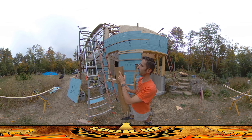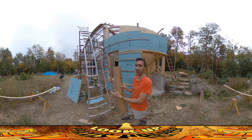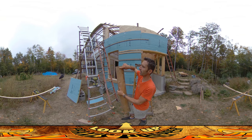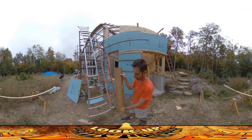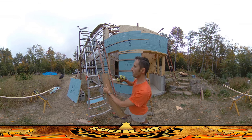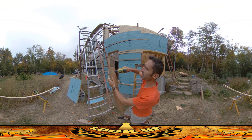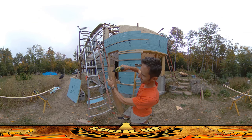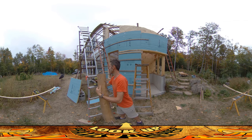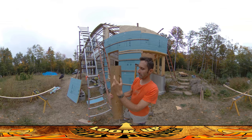This is a good opportunity to illustrate good places and bad places in a board to put a hole that you plan to put a nail through. A really terrible place is one that has a pre-existing crack going down it. A really great place is right behind a knot in the wood — they act kind of like ripstop fabric, like ripstop nylon. If I put it over here it might crack out, but right next to the knot it's obviously not going to crack all the way down the board, and if it wants to crack that way, the knot is going to bind everything together and prevent that.